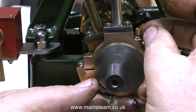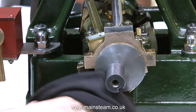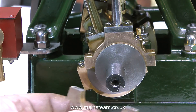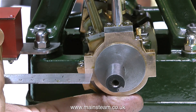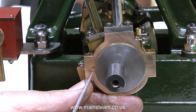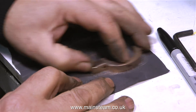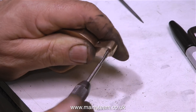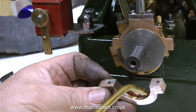What I'm doing at the moment is the opposite of tightening bearings — I'm dismantling one. This is the front eccentric that controls the engine when it's going in the forward direction. The reason I've taken off the bottom part of this eccentric is because I need to modify it, so I can connect a link to it to drive the lubricator. I machined a small block of gunmetal and then silver soldered that to the bottom part of the eccentric. I drilled a 1/8 of an inch diameter hole in the block, which I'm currently tapping 4BA, and I rounded the edges so it really looks like it's part of the eccentric.